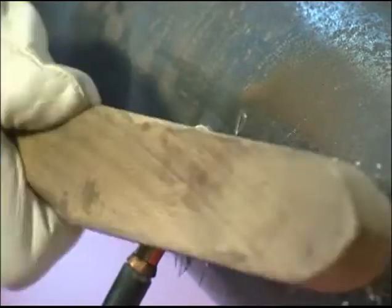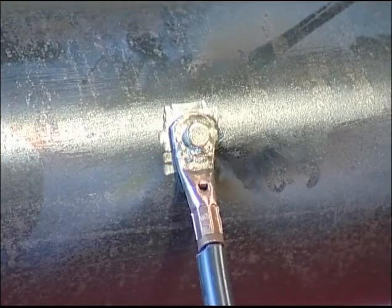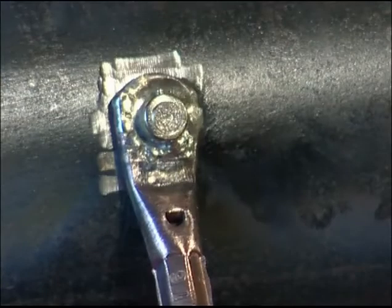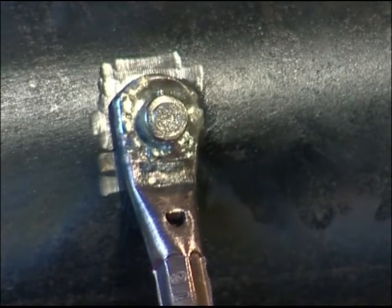Wire brush and inspect. Threaded pins should have an even spread of solder material around their base. Direct pins should also have an even solder pool within the lug and around the lug base. Excess on either side would suggest that the gun was being held at the wrong angle during brazing. The remaining section of the pin after the shank is removed should not protrude from the surface of the lug by more than 2 millimeters.